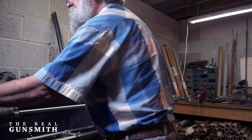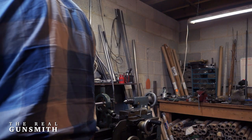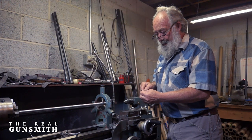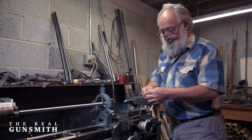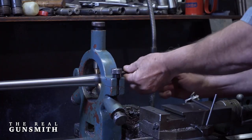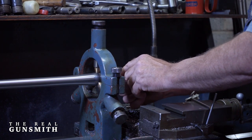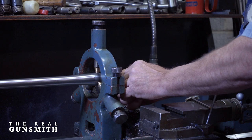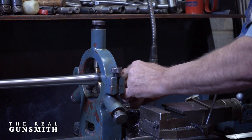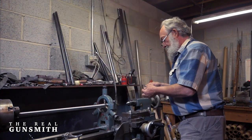Change the gears on my lathe so it will run fast. I've got some 400 grit paper here that I use — I wrap it around this little tool. Turn the lathe on at high speed and come in with the paper. The hand polish is progressing. Then change from 400 to 600 grit paper.